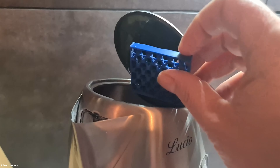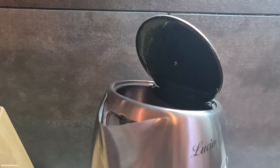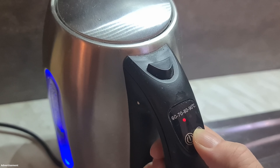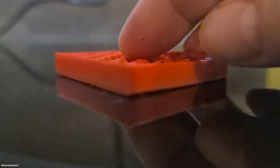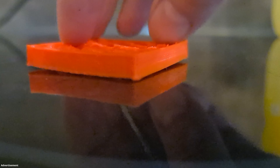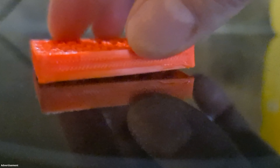Now that most of the materials have passed the test, I would like to take it one step at a time. I throw all the pieces into the kettle and set it to 70 degrees Celsius. PETG: we still see the slight deformation from before, but no deterioration. PLA+ post-crystallized: no change from before. PLA+ non-post-crystallized: significantly more deformed — I had not expected this. ASA: no change. ABS: likewise, no change recognizable.